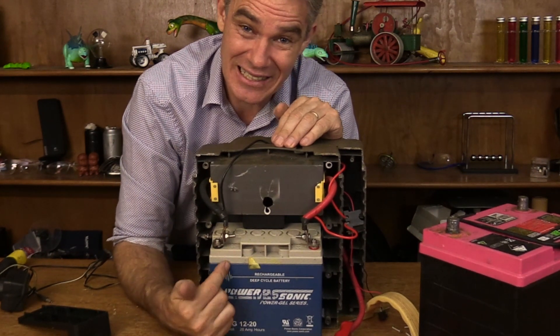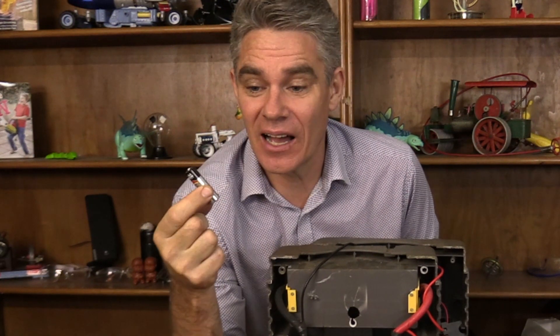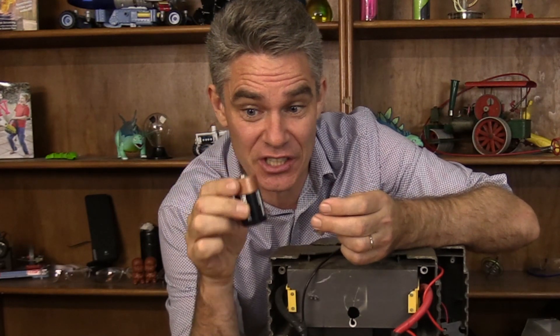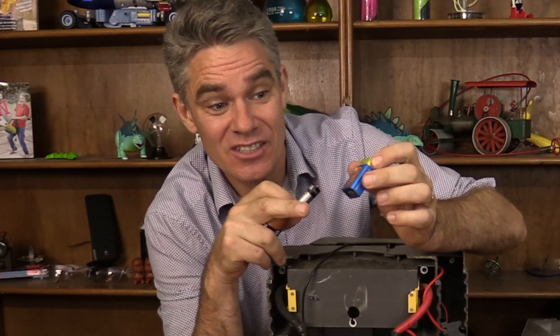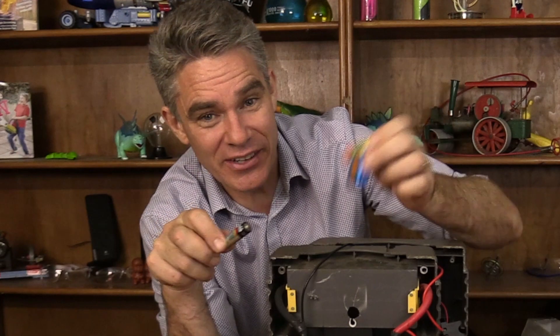Because there are six cells, that's what makes it a battery. So this AA is not a battery — it is actually a cell, a 1.5 volt cell. This D-size one is also not a battery; it's a 1.5 volt cell, same voltage, but it's got a lot more chemicals so it can store a lot more energy. Have a guess at what this 9 volt one is. It's not a cell — this 9 volt battery is actually a battery. The reason is that it's got six 1.5 volt cells inside, all in series to produce 9 volts. Six times 1.5 is 9 volts. So that's a battery and the others are cells.